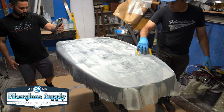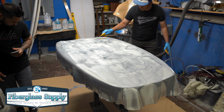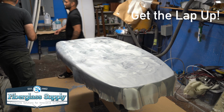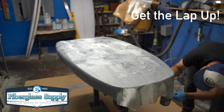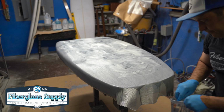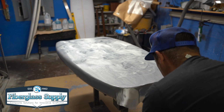There are some parts here that I've cut out, so we're going to skip pretty quick from this to lapping up the lap. But basically the idea is, get that resin spread out, let it soak in, and then do one pass where you're scraping a little bit more to get the excess off. So we've gone around, we've gotten that lap pasted up.